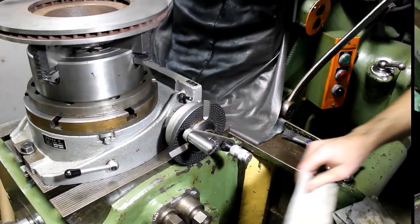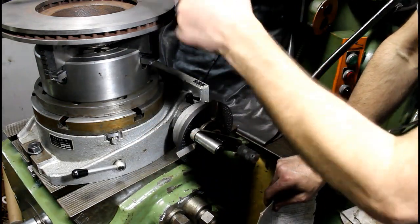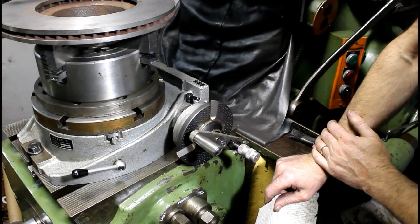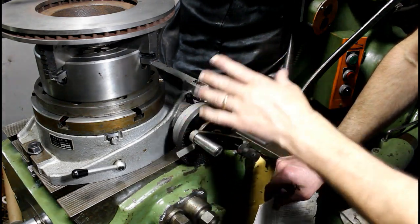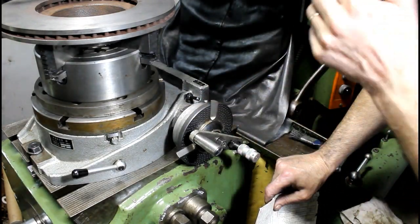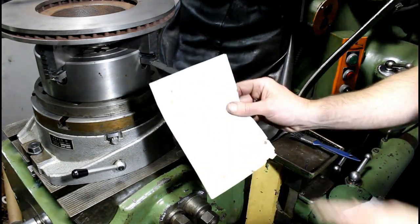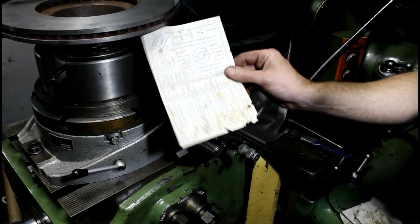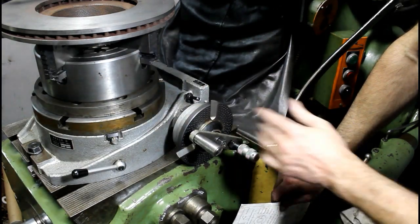I've decided that I want to cut eight slots in each side of this rotor. This rotary table did not come with the indexing plates — I had to buy them separately. I think I paid like 60 or 80 bucks for them. That's the kit that comes on here so you can index. You don't have to have an indexing plate — you can do the math and index easily without this, but it makes it a little easier. The indexing plates kit comes with a chart that will tell you what string of holes you need to use to get a certain number of divisions. I've chosen eight.